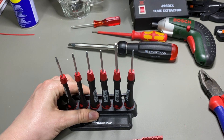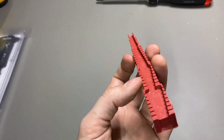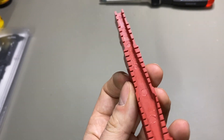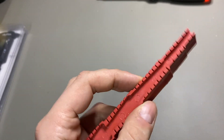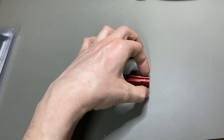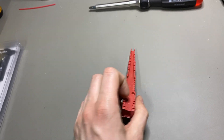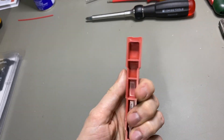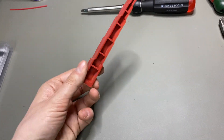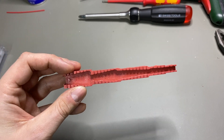One of the last tools I recommend if you're getting deeper into electronics and making your own circuits is a component lead bender — a tool where you put a resistor in and bend it down to get the right pitch between the connectors so it fits easily into your circuit board. It's just a couple of bucks, not expensive at all. When I was young I should have bought one earlier because I always struggled bending resistors into the correct shape. If you're serious about electronics, I highly recommend buying one.